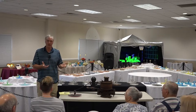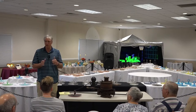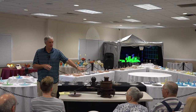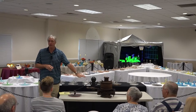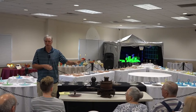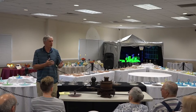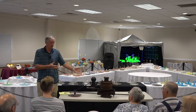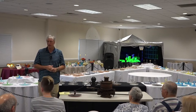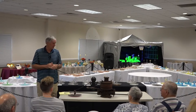We make bells this way. You make the top part in the shell mold so there are no joint marks in the bowl portion, although there will be joint marks basically from that bowl portion down. And you can make different handles using the same mold if you had another handle mold. Because you can make it fit, you could make dolphins or a variety of different handles if you just change the bottom mold. So that's one of the flexibilities of this design.